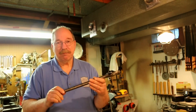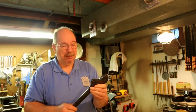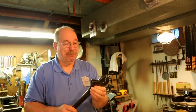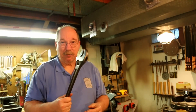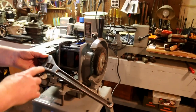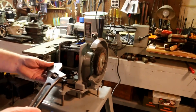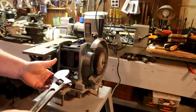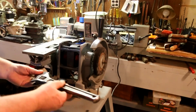Not a big deal. All I did was just take the rust off — took the screw out, cleaned it up, oiled it, made it work better. To clean the rust off I didn't need to do a whole lot. It just had a little bit of surface rust on it, nothing major. Didn't need to go with electrolysis or acid wash or anything else. Just wire brushed it.